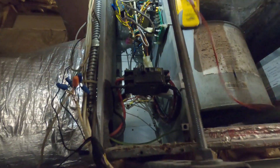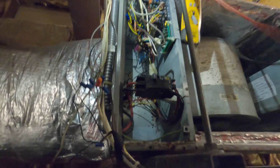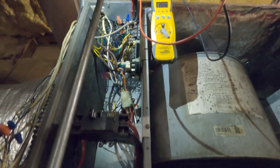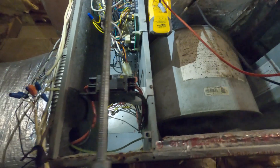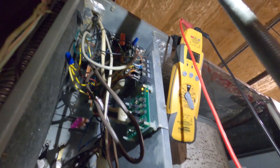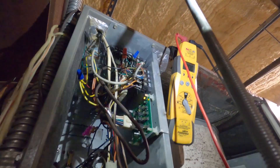Let's see if we've got 24 volts going to our terminals here. I'm really just worried about the G call — I know the outside unit is getting a call. Sometimes thermostats will cut out the G call; G is for the fan. We've got 24 volts. If you look on this board here, it's saying 'run,' so it's acknowledging that it's getting the 24 volts from the terminal making its way to the board.